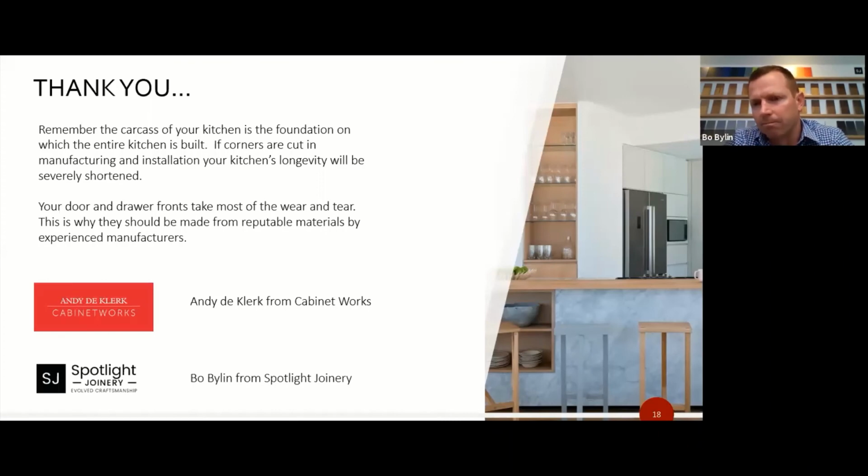The biggest challenge, Andy, is when you get your stock standard cut and edge boards. If your kitchen company or your joiner is really aware of this type of thing, he would need to go through to the board supplier. Often what happens is, if you have a stack of 25 veneered boards, you'd ask your board supplier to open up that stack, and you would choose 10 to 12 boards, however big the job is, and you would need to ensure that that grain is all pressed out of the same batch and put to one side. It does get a little bit challenging if your job is bigger than what is available from the potential supplier. If you do have enough lead time, you can ask for more boards to be pressed out of a certain batch. But yeah, they should be aware of this.